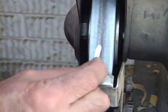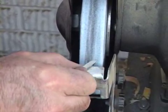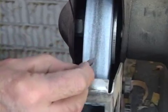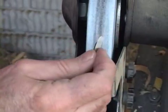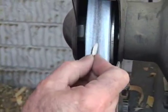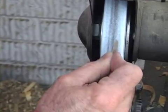We don't put it on the tool rest. If we try to put it on the tool rest, it's not stable enough, it can get sucked down underneath there, and your fingers are too close to it. So rather than putting the tool on the tool rest, I'm going to put my hand on the tool rest — now I've got control of the angles and the movement of the tool, because my hand is a stabilizing force on the tool rest.